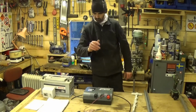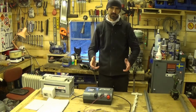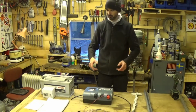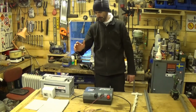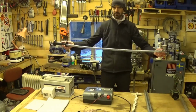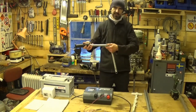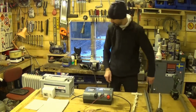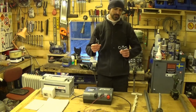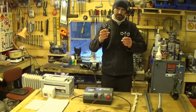I'm talking about gates. What do you do with the gate openings? I've done nothing with my gate opening because the wild boars apparently don't go through the gates. And that's a little bit risky because maybe one day they're going to, and then they'll be stuck inside because there's electric fence all the way around. But I'll worry about that if it happens. What you can do with a gate is one of these big springy things. That goes from one side to the other, and this will be live. There'll be power in this. Now what you need there is a special type of isolator that insulates the big springy gate thing from the posts, but energizes it. And that's these things here.